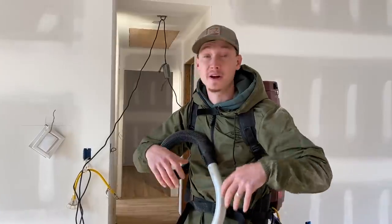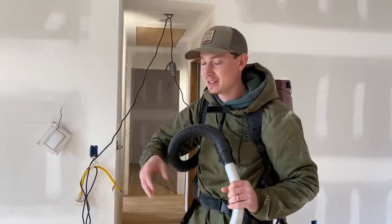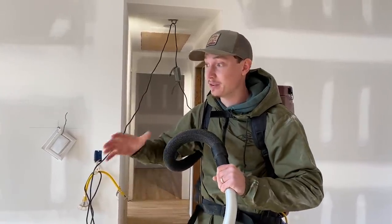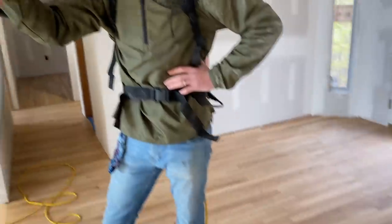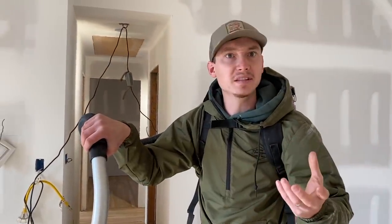It's just not on a very aggressive scale. It's not like you're spraying water and wiping it off. It's actually just a water-based finish. It's way better, and it's just going to make the floor look as natural as possible. Not like what most of the time people will do, polyurethane, which is oil based, right? Yeah, it's like a urethane oil-based type of stuff.